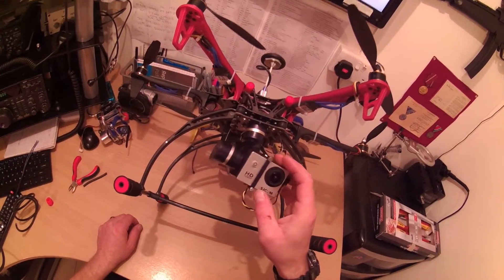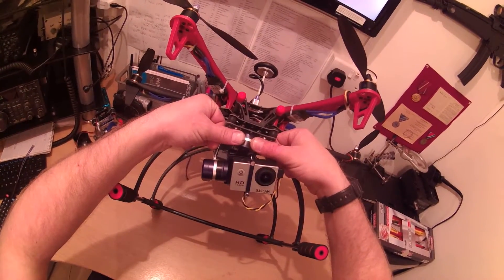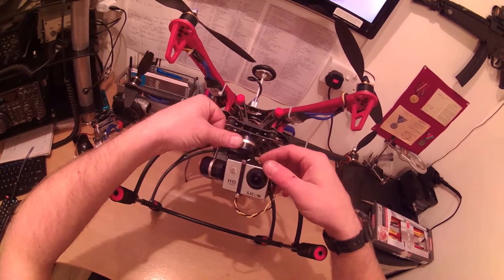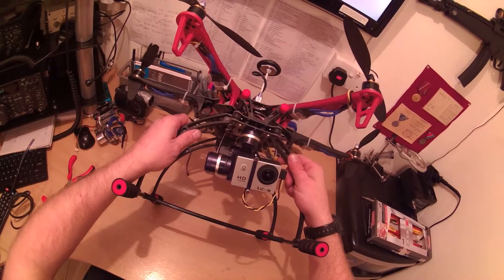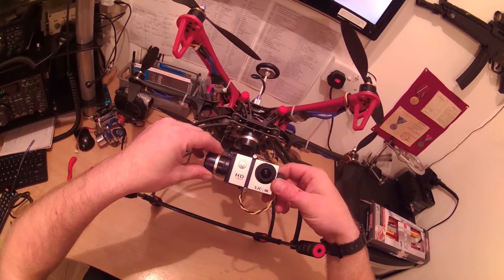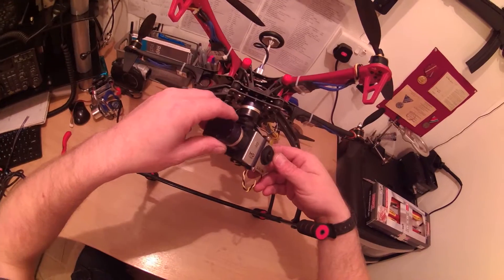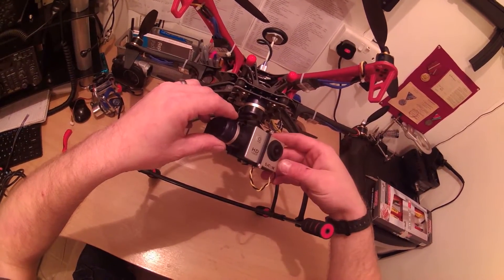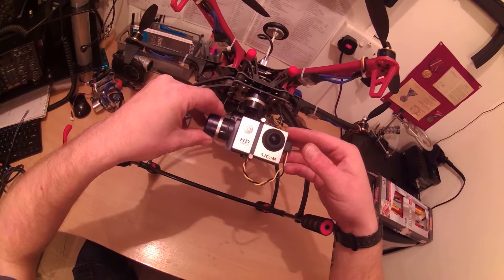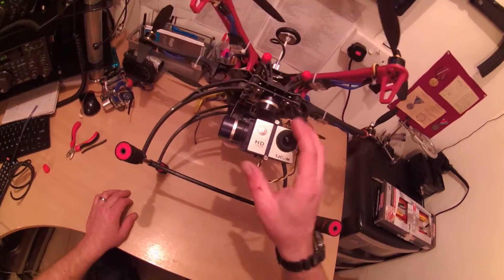The only thing I still don't like is the yaw heading follow. I'm hoping a software or firmware release will help correct that. I'm actually thinking of hot-gluing the gimbal on the third axis for the meantime and just using it as a two-axis roll/pitch. The problem is when flying forward the gimbal can be pointing off a bit — then the camera starts to come around and I'm not flying the direction I want. It doesn't correct itself quickly; if I turn the hex really fast it catches up, but if I pan slowly it slowly follows and when you stop you're pointing a different direction. Very annoying.